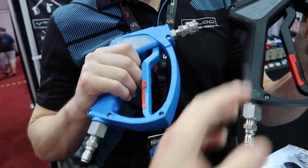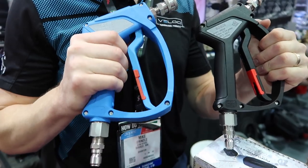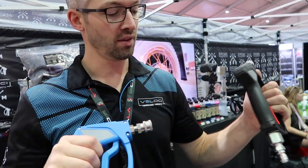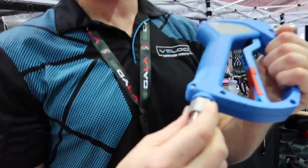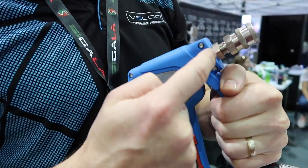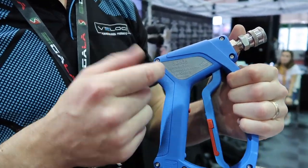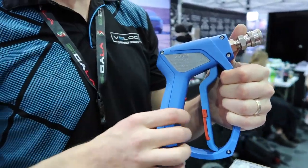What about the trigger? It's still an easy pull trigger. The cam system is slightly different on the SG-35 because it's a bigger gun. This is still a prototype, so we're not going to have these until probably about March of 2020. But it is an easy pull. You have your stainless swivel built into it, your nickel-plated brass valve body, which is very important to the resistance to chemicals. Inside, the seat where the ball sits — there's a stainless ball and a stainless seat. Both are 316. So it's a higher grade of stainless inside.